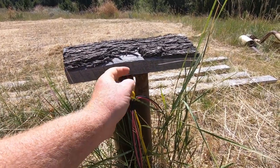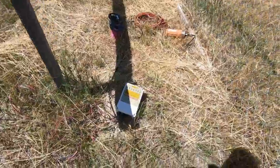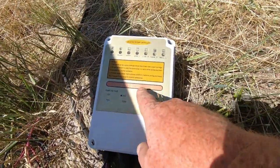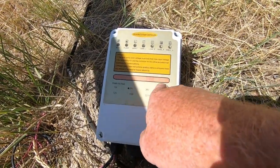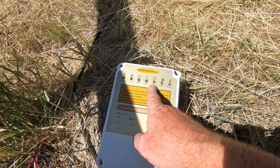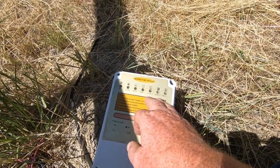This is a progressive cavity pump, something I'd never heard of before — a very strange design, but it works excellent especially for low wattage and low voltage applications. The pump was advertised as 24 volt, but it wouldn't run on a 24 volt battery system. It says right there 'do not run dry.' When I hooked it to the batteries it kept giving me a low power light — it would pump for a few seconds, the low power light would come on, sit for five minutes, try to kick back on, and give a low power signal again.